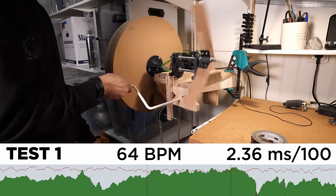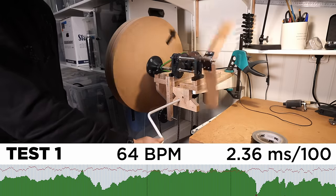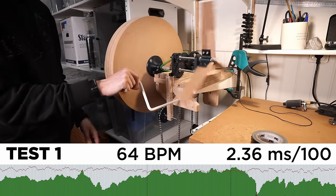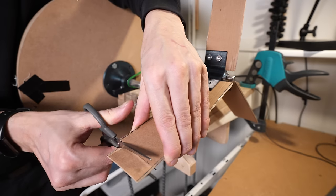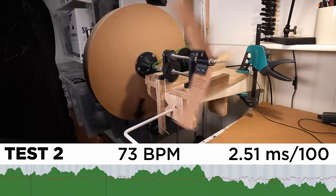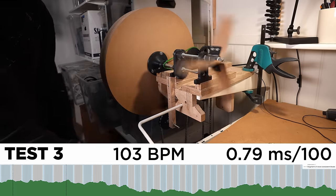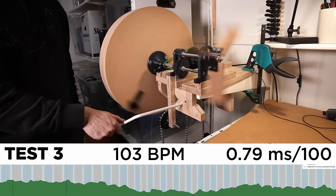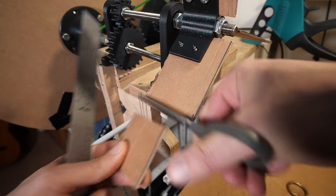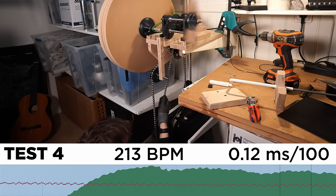For each test I turn the machine between 10 and 15 minutes to get really good test data. With the faster air governor, the tempo of test 1 was only 64 BPM. I shortened the fins for test 2 and the tempo increased to 73 BPM. I shortened the fins again and in test 3 it played 103 BPM — a good illustration of how the governor works: the less resistance it puts into the system, the higher the balanced tempo becomes. For test 4 I wanted it much faster, so I took off a lot, but then the center of the 3D printed miter gear broke, so I couldn't use the crank anymore and had to manually pull on the chain with my hands.